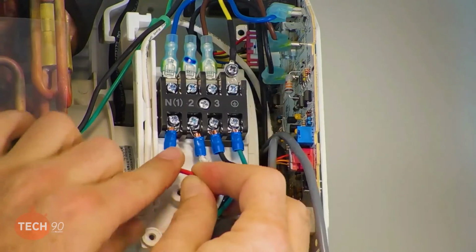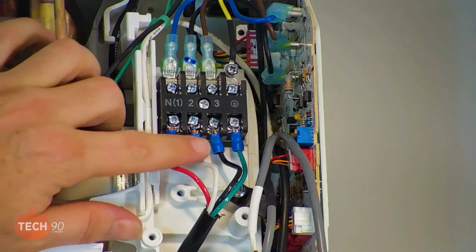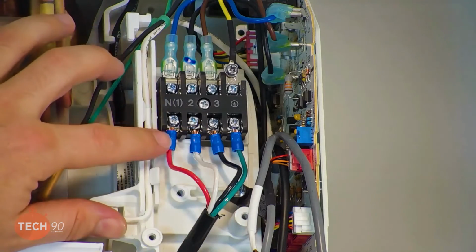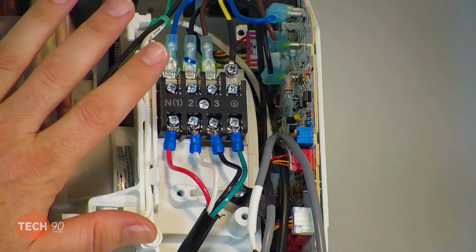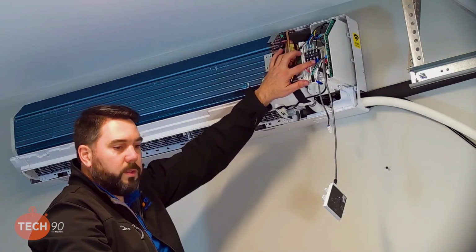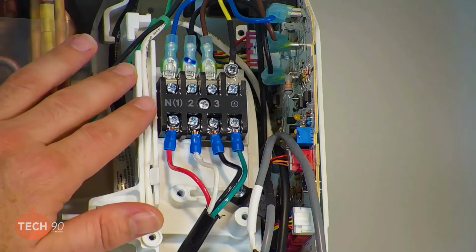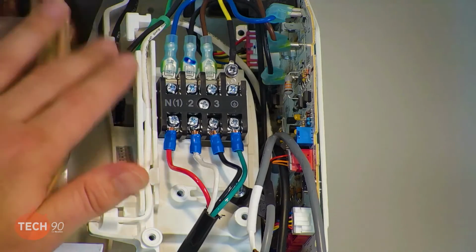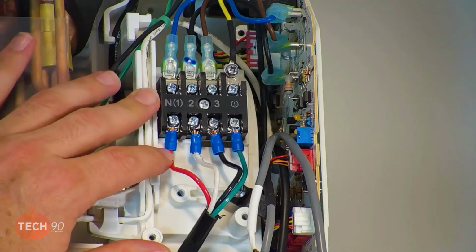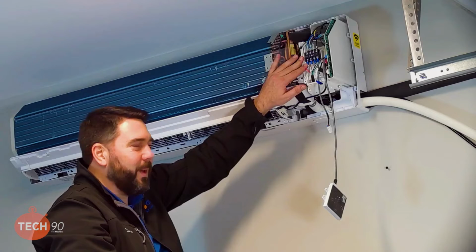So if I was going to have to hook a condensate pump up to this, Daniel, which wire do I break for the float? If you want to hook up a condensate pump, you want to break 3. The reason is because if you break 3, the unit shuts down. You can break 1, but the unit's going to sit there and beep. It's going to do the same thing if for whatever reason there's a break in the wire or you just don't have the proper voltage. If there's no voltage on 3, then it's not going to do anything. If there's no voltage on 1, let's say for instance outside L1, L2, you've only got 120 on L1, the unit would sit there and beep. Okay, so it'd still shut it down if I broke 1? It'll shut it down. It won't work anymore, but it'll beep until the service technician gets there. So not the best idea. 3 would just be broken and not making noise. I get it. Fair enough.